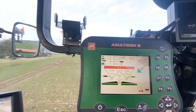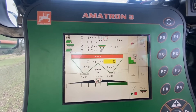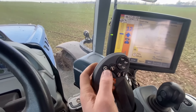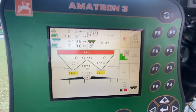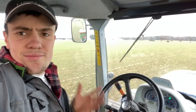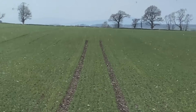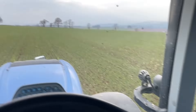Pull up to the end here — that'll shut off itself. Drop down, nudge it back into reverse, swing round here. GPS button there — that'll square me up. And you can see it picking up again to 250 on each side. And that's it, spreading full. Easy peasy — all I'm doing is just painting the field really. Everything's going smoothly. Where's the tram lines gone? Something must have happened with the drill — it'll not matter, just as well I'm on GPS. The combine's just come back now. They've done their recall on it. So basically in the separating drum, there was an issue last year — one went on fire. So they've cut out sections and put in a fan-shaped thing which allows it basically not to block anymore. It was blocking up with stalks and friction was causing a fire, so it's not to block up anymore.